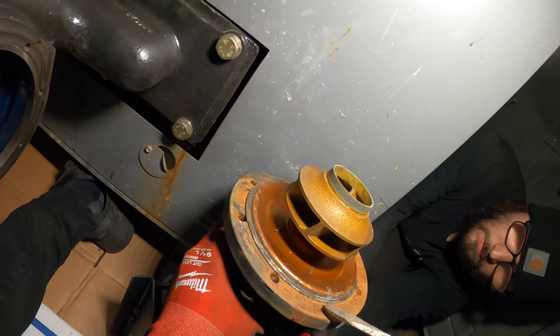Let's get the new hot surface igniter in there and put the two wires on. I'm going to cut off that old connector. Look where the wires are up top — these were a lot longer before, but I'm pretty sure this is the unit that had a fire in it so the wires were cut back. I'm just going to use some of this wire — it's going to look rough but right now I just need this thing to work. It is what it is — it's going to work.